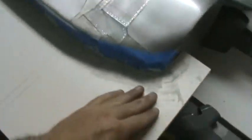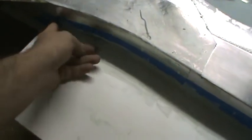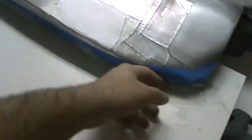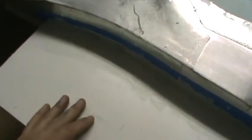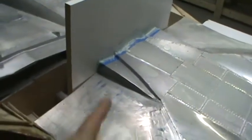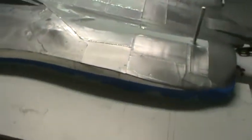Here coming along the backside on this other parting board, body filler is here. I put blue tape again on the fuselage just to save myself some hassle — it seems to peel off. In hindsight, I probably should have put a coat of mold release wax on there to make it even easier to come off, especially there just because of the shape of that one.